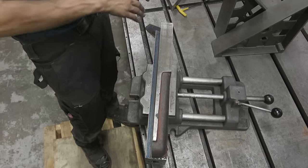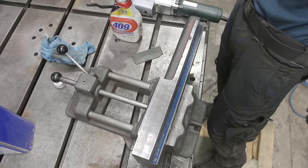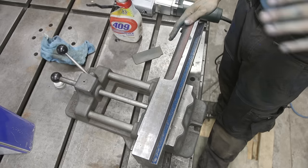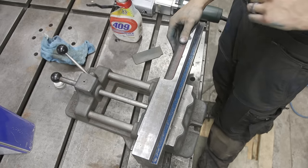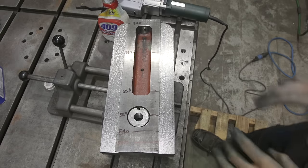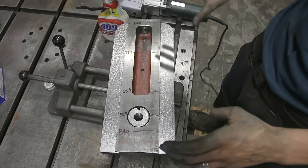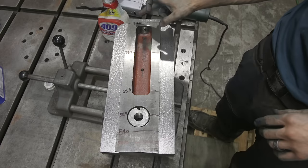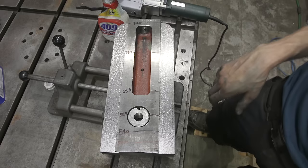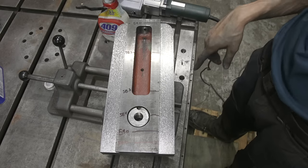Let's get this back over to the master and make our fine adjustments from there. Finally coming down to the home stretch — now that we got this off the master we can see our print is looking really good. Let's get this guy flipped over and see how we're measuring out. Overall I'm really happy with the points per inch and coverage, but I'm really interested to see the measurement. With the part flipped over: we're not quite where we need to be but we're close — about 7 tenths of a dip in the middle. The ends seem very consistent at 59 each and the center is about 58.3, so that's a 7-tenths dip in the center. I'll work this more off camera but we are getting very close.